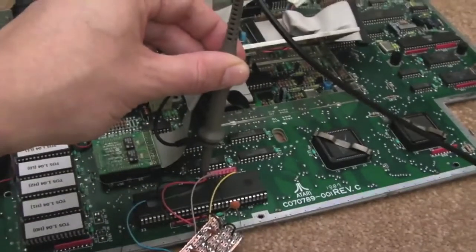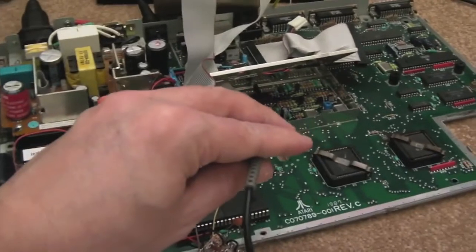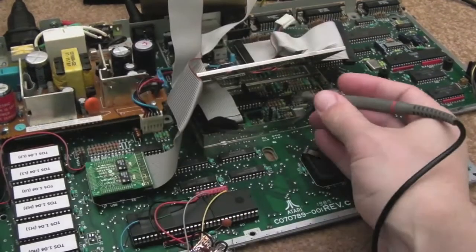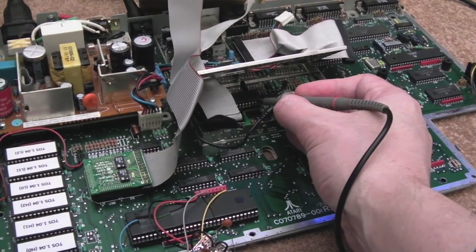Now if I do the similar thing, if I take that off, in fact, you'll find, there you go, it just freezes. Dead, died. I'm guessing I've got a CPU halt or something going on there. If I do the similar thing on the 16 MHz clock pin, and I'm taking this from pin 39 here, I've probed all the other pins, I can't see anything else that looks remotely 16 MHz-ish.